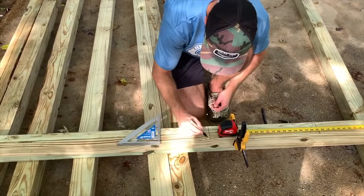After finishing the front wall, we repeated the process for the side of the shed on top of the veneer. Here we had to cut along the angle of the roof, which we did with a circular saw, and then it's just a matter of getting the individual planks to interlock and then fastening them again with the construction adhesive and the brad nails. Here I am fastening the last piece on one side. Then I just repeated the exact same process for the other side of the shed.